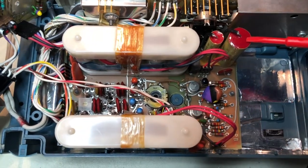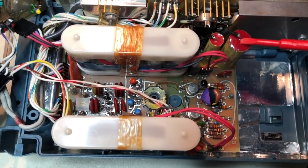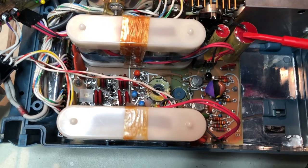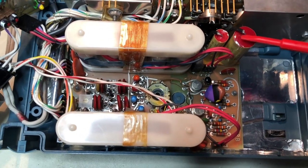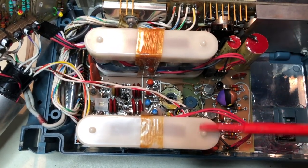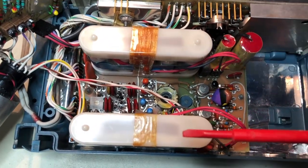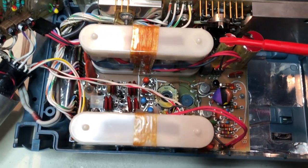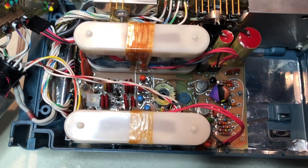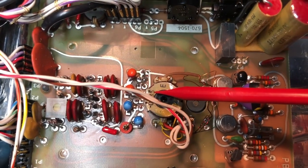A couple of quick things. First, these capacitors are selected for very specific input voltage and frequency because capacitive reactance varies according to input frequency — so refer to the manual to figure out what capacitor to use for a specific input voltage. Second, these batteries are not just batteries, they are capacitors as well, because there is no power supply filtering in this — the battery is the filter. So if your batteries are dead, it can sink the current and keep the instrument dead, or if they are completely open, it won't even filter. Don't try to operate this instrument without the batteries.